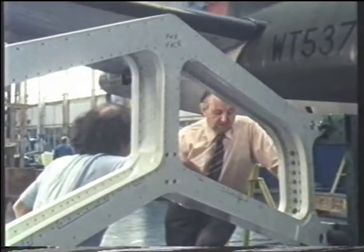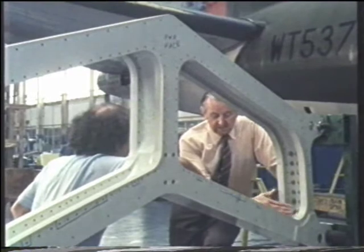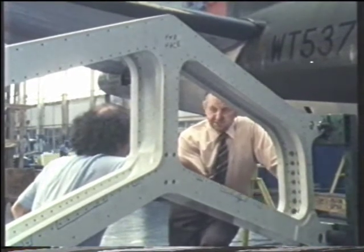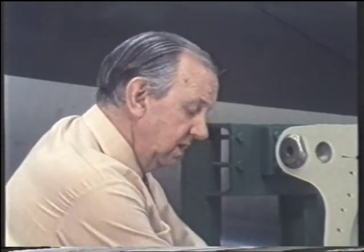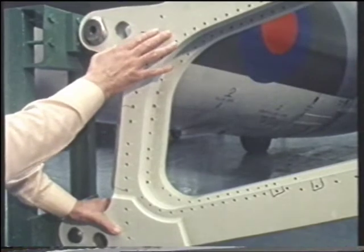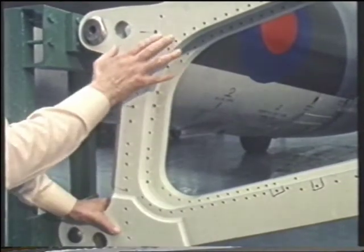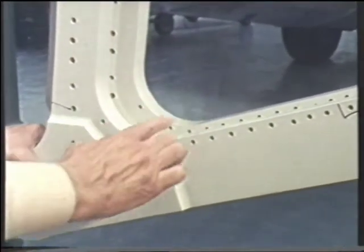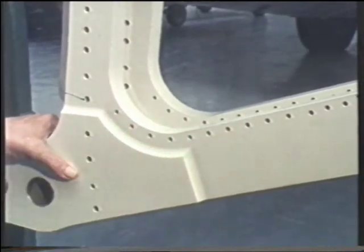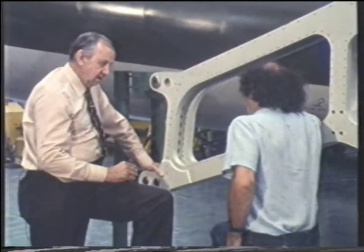And finally: aggressive environment. We looked at the atmospheric conditions and found that this area was a natural well for condensation. The steps we took were to fill this with foam and put a drain hole in the bulkheads. When this forging is assembled in the aircraft, there is a bulkhead right over the area, and we put a drain hole in so that any moisture which collected could drain away.